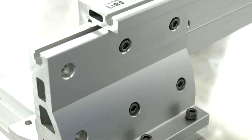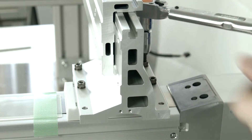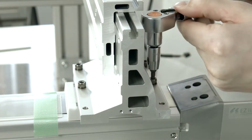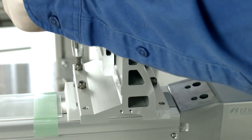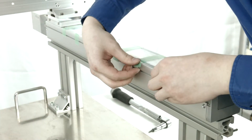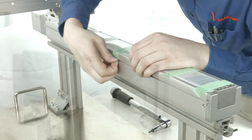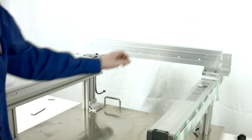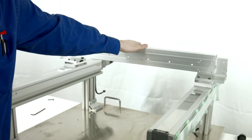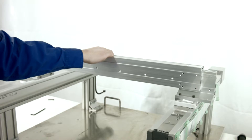Torque bracket A to bracket B and B2 to 5 Nm. Torque each of the M5 by 18 bolts holding bracket B to 5 Nm. Remove the covers from the X slider and X guide rails. If you will be reshipping the robot, let the covers hang off the side for later reattachment. Using your hands, gently slide the X axis for visual and auditory inspection. The X slider and guide should move smoothly with no binding.